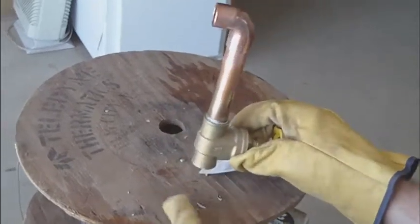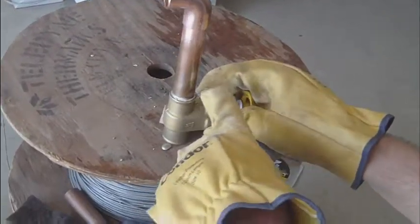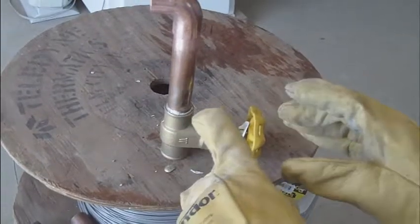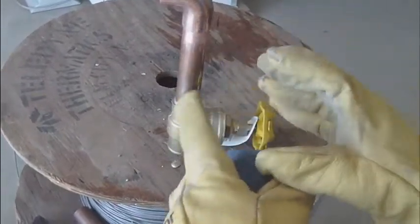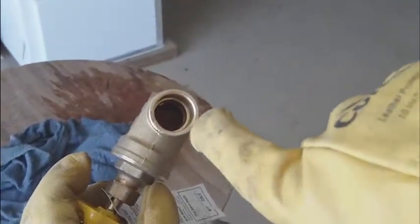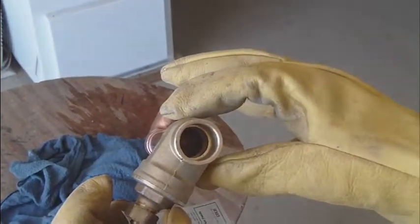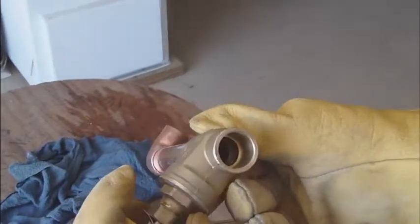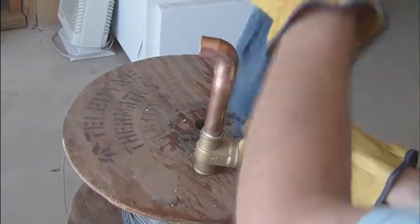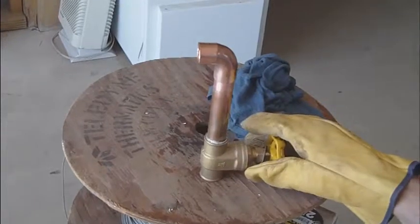I used a little bit of excess solder, but you can see how it's clean and formed around that lip and the edge - that's really what I'm shooting for. I want to get it hot enough for the solder to flow around and flow into the seal. And if I look inside here, I can see just a touch of solder - just one single little spread of solder where the lip of the gate valve and the copper come together. That tells me the solder wicked all the way through that copper between the gate and the copper pipe down to the bottom. I'm pretty happy with that solder joint. There's no way at this point to tell whether it's a sealed joint, but I think this is a solid joint.